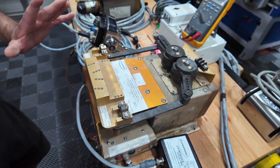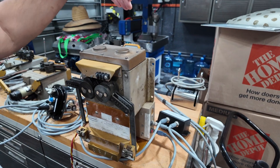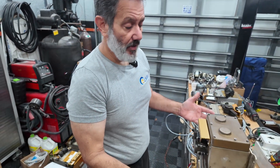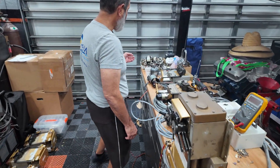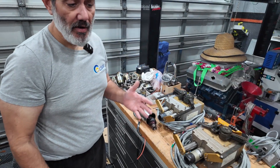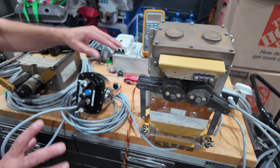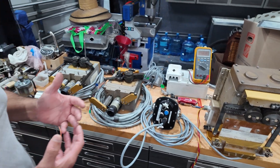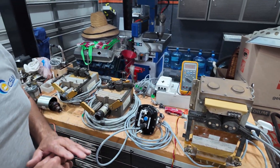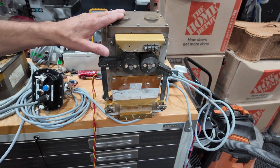Then we've got a smart actuator that got submerged in water. According to the customer, it was sitting vertically on the bulkhead, the AC broke its line, water went down and flooded the whole compartment, so the board got completely destroyed. I had to put in some new components — water damage does a big part. We ended up changing the motors and electronics inside. What we like to do is at least run a 24 to 48 hour cycle test, leaving it on and going back and forth within the hour to make sure the system is operating to specs. When it goes back to the customer, all he has to do is recalibrate, install, and he's ready to go.